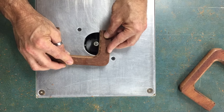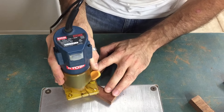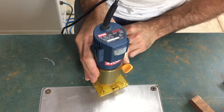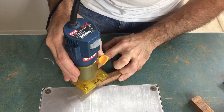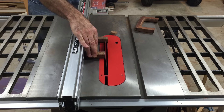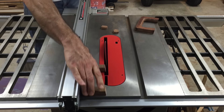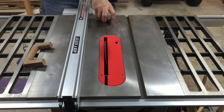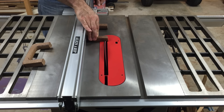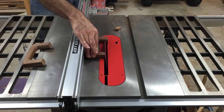The outside edges of the handles I just used my trim router with, I think, a 5mm round-over bit. With the basic handle shape now done, all I had to do was trim them to height. I trimmed them once and they felt too high, so then I trimmed them again. The angle of the blade is set at 7.5 degrees — that just felt comfortable. I wanted a little bit of a slant on those handles.